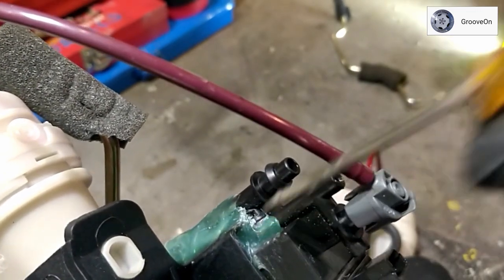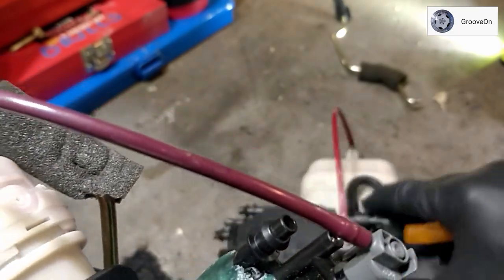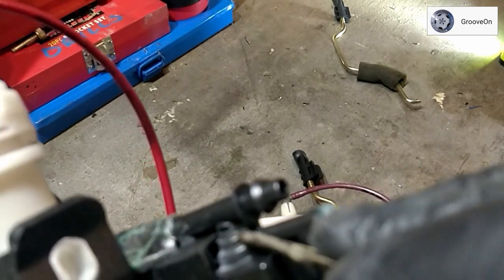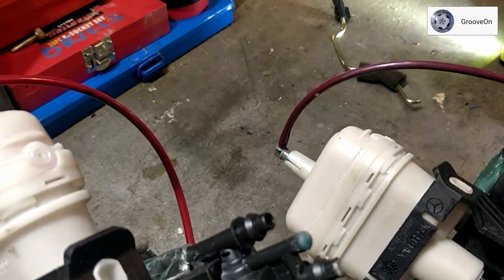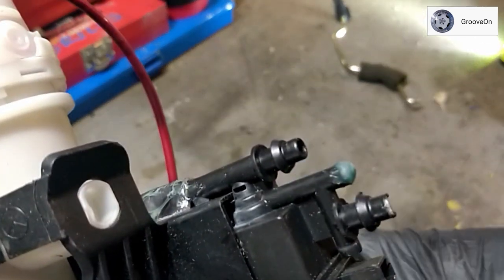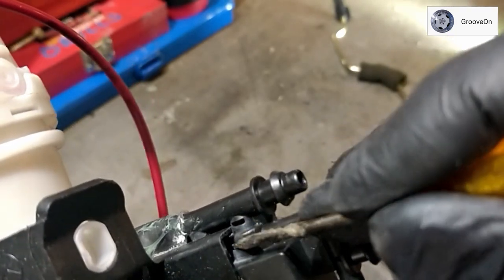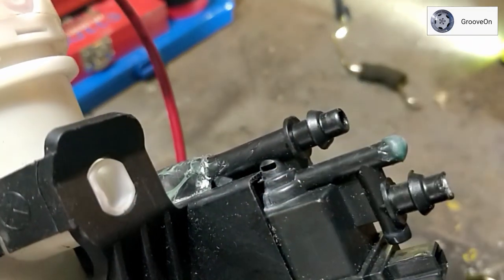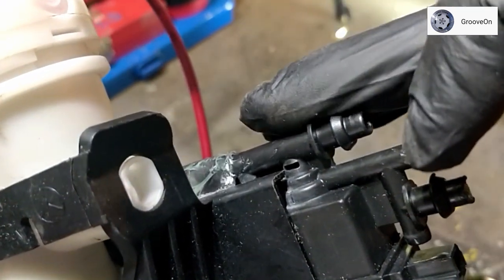Moving round to the back corner, I've found there's sometimes an issue with it leaking there. And just underneath — swapping over to this unit — there's a little hole here. You have to be careful because you must leave that hole open as it's a vent hole, but I had a slight leak just below it and had to seal around it. That one is a bit more unusual in my experience.